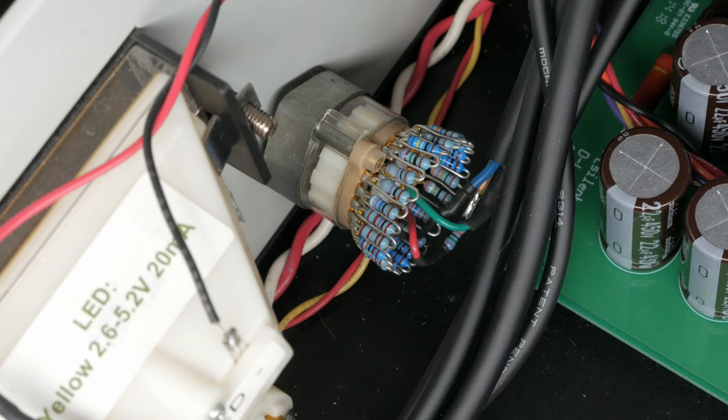One other thing, the gain pots are 25K each in my build. These are wired in series with a 75K resistor. This provides a more usable gain control on the unit. Without this setup, you'll be operating the unit within a very small section of the gain pot's sweep.